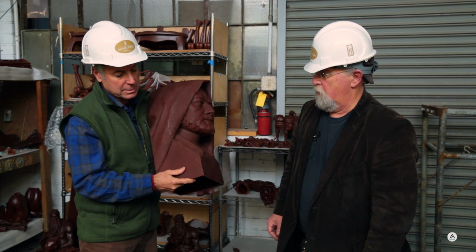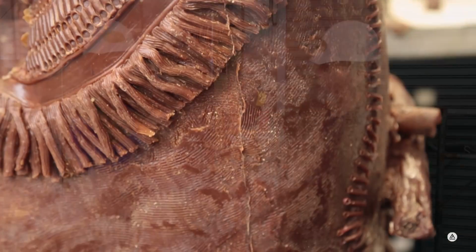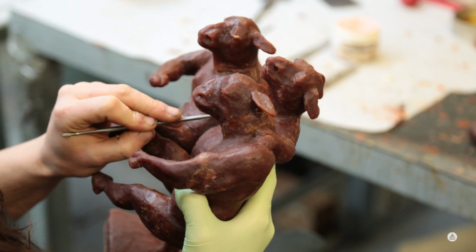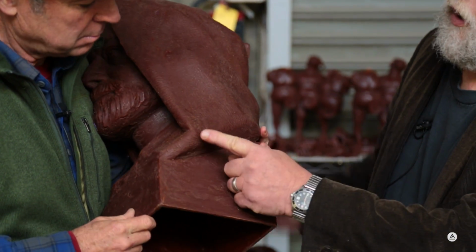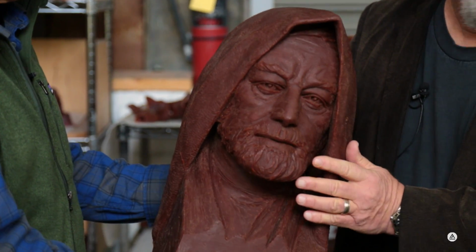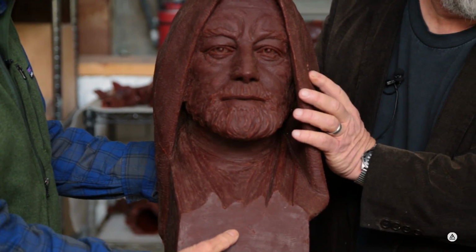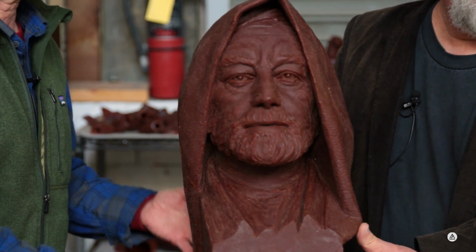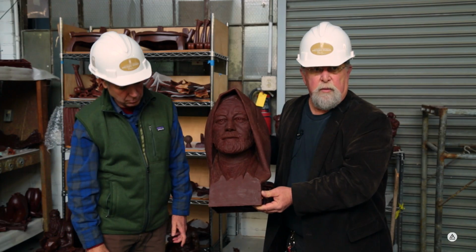When the wax comes out of the mold, there's normally a parting line where the 2 mold halves came together, and that's what our technicians here in the background are working on to clean it up. You can see that parting line right here, all the way going up the side. And that needs to be taken away, and then it needs to match what's to either side of it. And that's part of the ability and the craft of a good wax person, they know how to make that chasing so that it reverts back to what was originally in the mold, and now everything you see in wax will now become bronze.